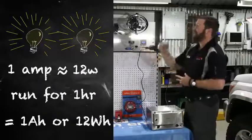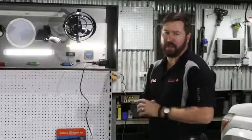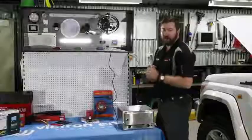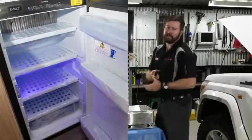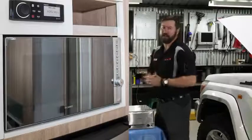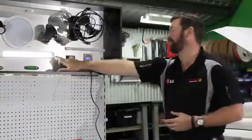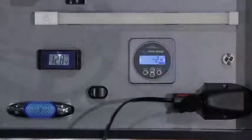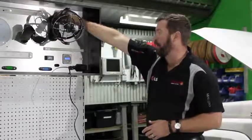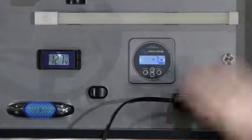Lighting, fans, small speakers and things like that aren't drawing a lot of energy out of our batteries. The main items we need to be concerned about are our cooling devices — refrigeration — and our heating or cooking. Those are our larger items that are going to drain our batteries pretty quickly. With the lights and fans off, we drop back to just a standby load of two watts. Looking at a small Sirocco fan on low, medium, and high, it's drawing five or six watts.